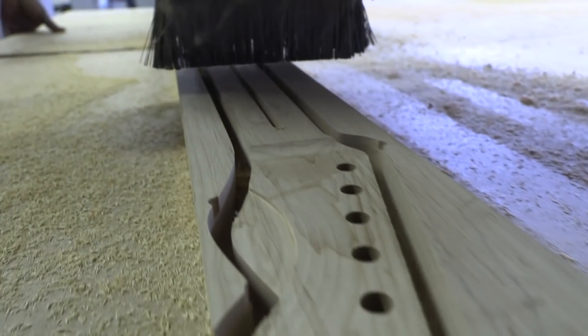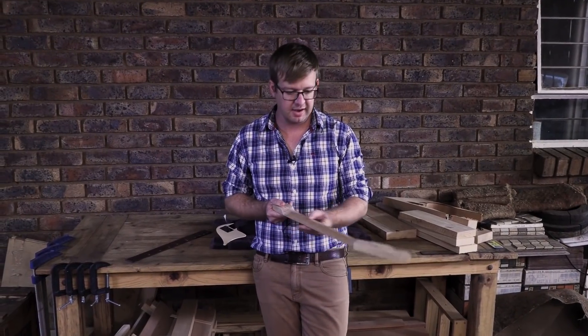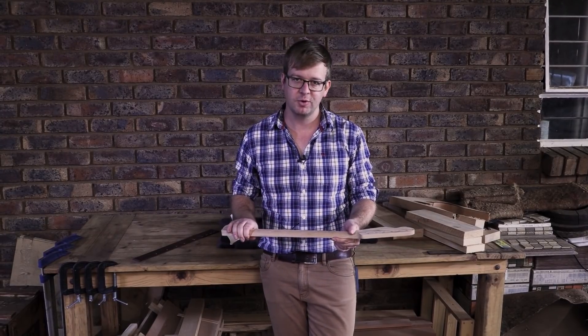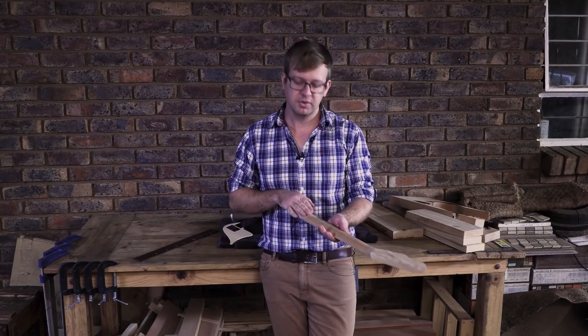With the neck — which CNC actually made a lot easier — on the back I have a convex contour, starting from one radius and ending at a smaller radius. With the CNC machining it was a lot easier to achieve that contour than setting up and doing it by hand.